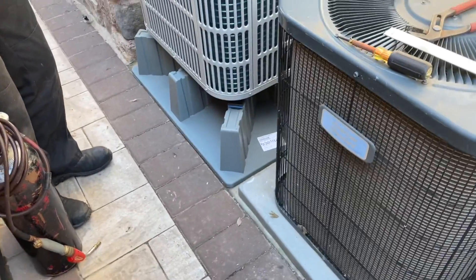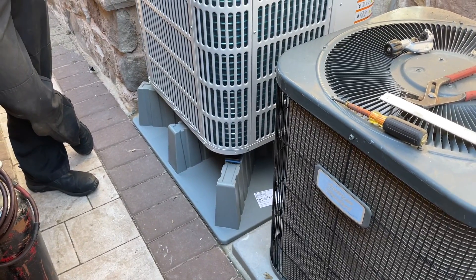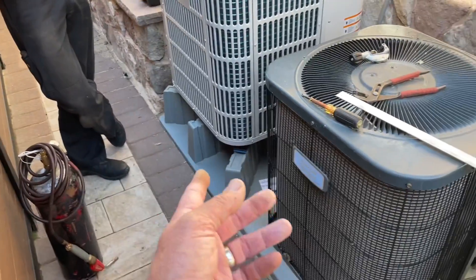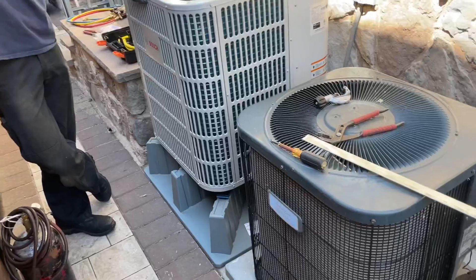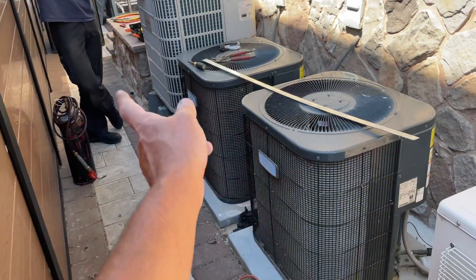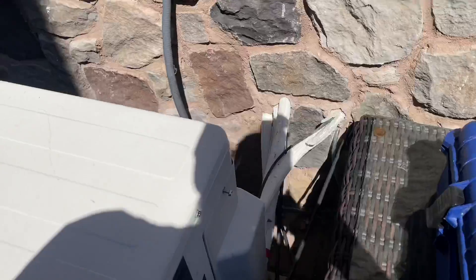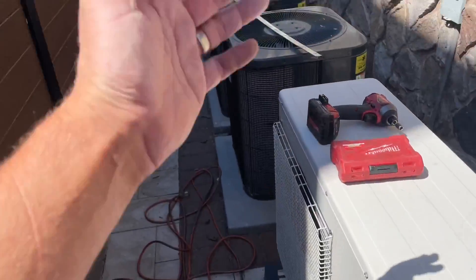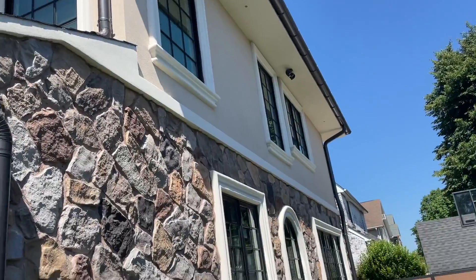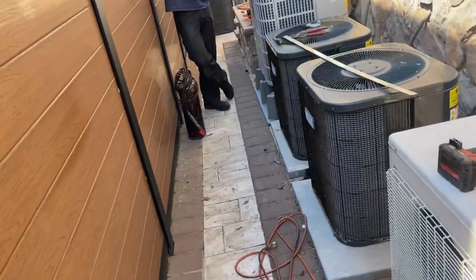The purpose of the high-rise pad — if you use it for a heat pump in the winter, all the condensation is outside, so in freezing conditions you're going to have ice, but at least not covering the unit. I like it because it gives a little more clearance from the steps and from the other units. They are still way too close, but we are going to slowly replace the other systems here. Hopefully the next ones we do we'll try to shift everything over and utilize this whole strip on this Taj Mahal. It is what it is — this was approved by local code.